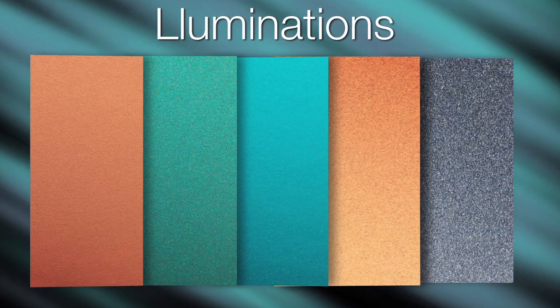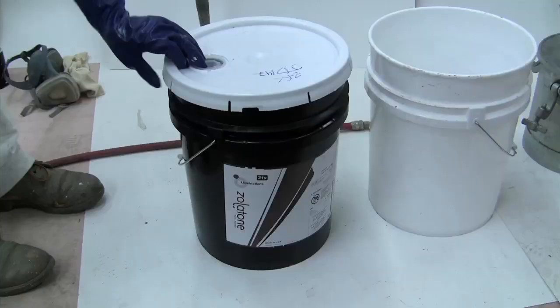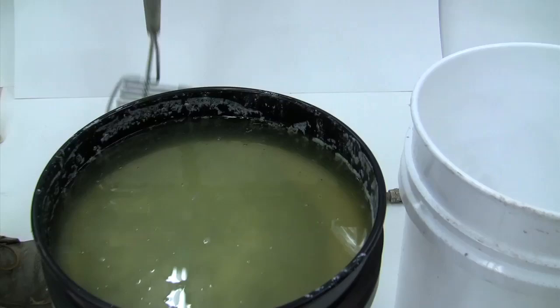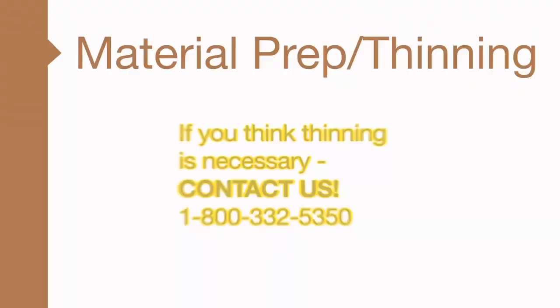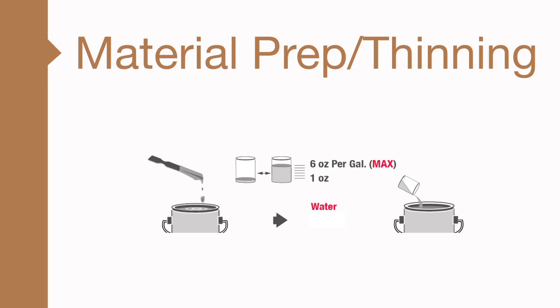Zolotone finishes require a white primed surface. To achieve its unique characteristics, each color has been spun into a tiny ball. These paint balls are then suspended in a water-based acrylic liquid, blended to create the specified final color. When you first open a can or pail of light reflective finishes, you will see that the product may have settled. This does not mean it needs thinning. If you think the product needs thinning, stop and contact us. While it is okay to add up to six ounces of water per gallon when necessary, best results will be achieved if we can test the product first in our lab.